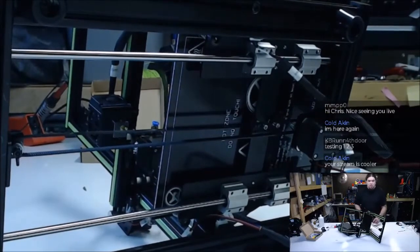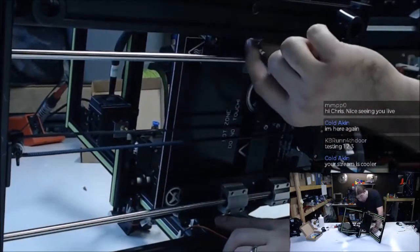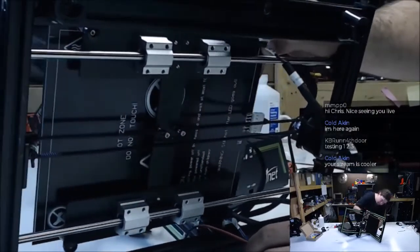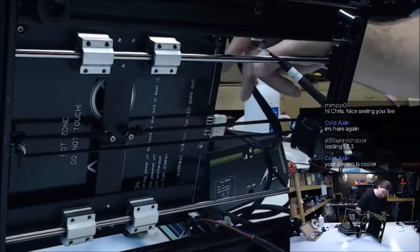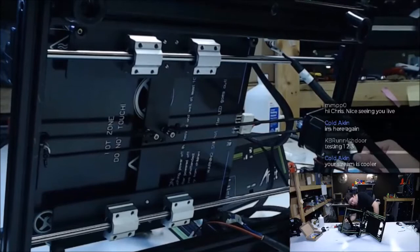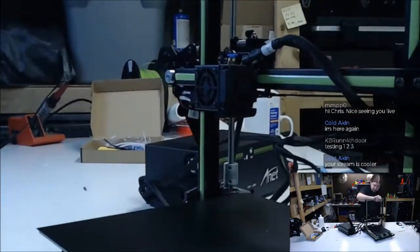So, the Z motor plugs, one facing this way and one facing this way. You can see that when the bed carriage comes by, it clips the plug. Is not good. And they assembled this part from the factory. So that's how they intended it to be. How's this one? Yeah, it hits both sides. For that to work, those would have to be shaved down, I don't know, quarter inch? I guess that's the only thing we can do.